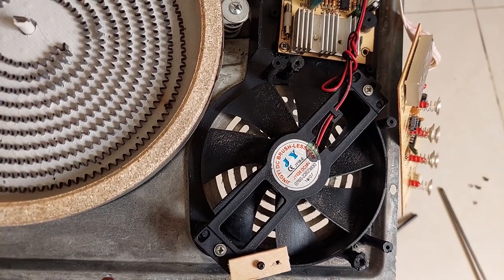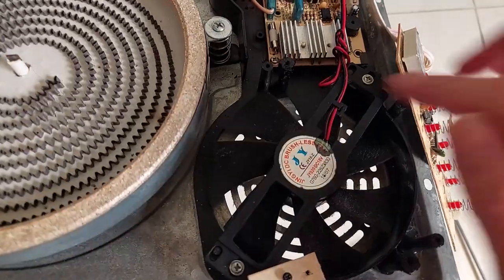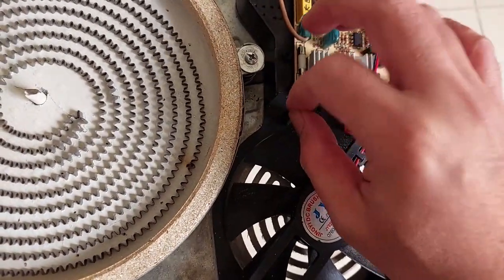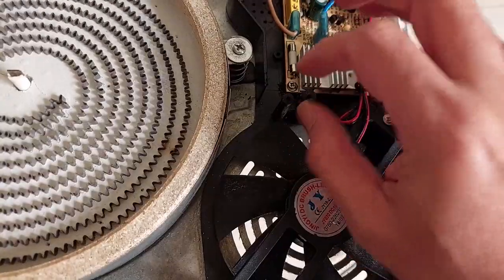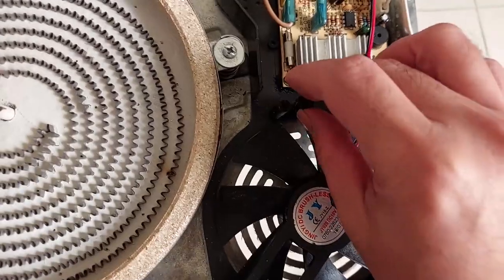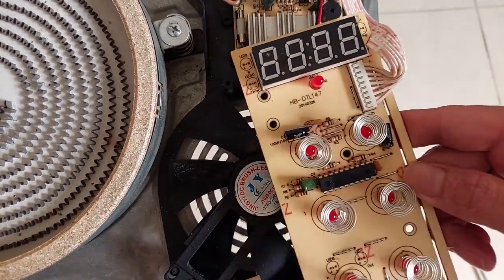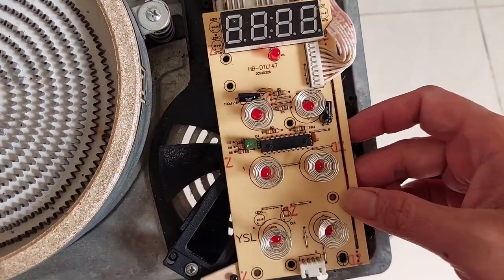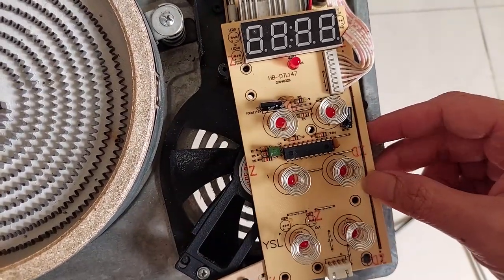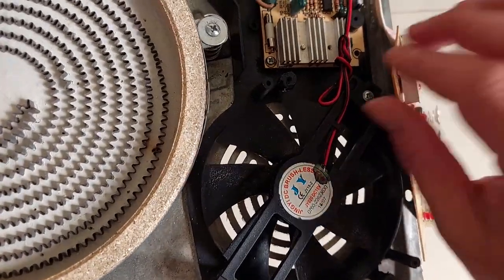These days cookers, especially the electric ones, are not made to last forever. The plastic is not heat resistant — although maybe this one is made from more heat-resistant plastic, in the long term it will break. So the position for the touching panel will be off because the screw is loose or the position is not right. That's the second possibility.